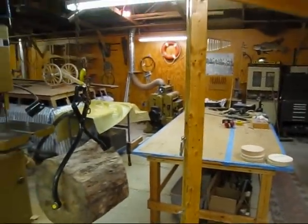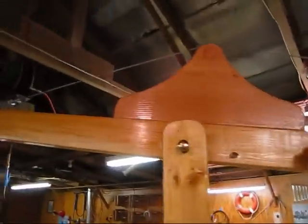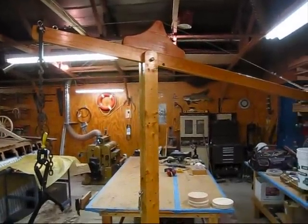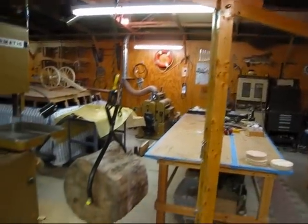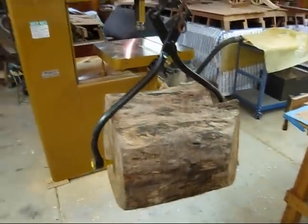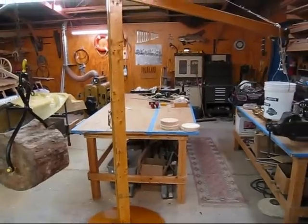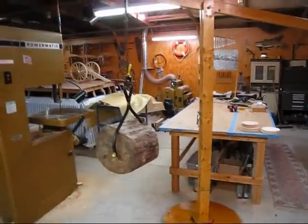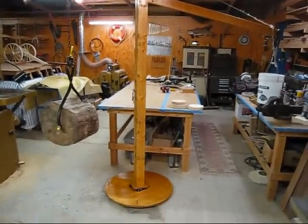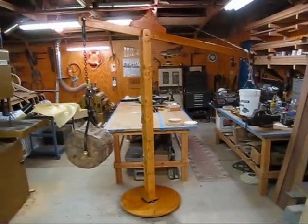I'm real happy with how it came out and I'm looking forward to going into the field and lifting some logs with it. Now that I have this top member stiffened, I wouldn't be afraid to lift 175 — maybe 200 pounds max — but I probably wouldn't want to go over that. That's going to cover most of the wood I bring to my shop, since I cut it to length 18 to 24 inches, and unless it's a huge round I'll split it on site. I think it's going to work well for probably 90% of the bigger stuff I cut up on site, and I'll be able to just lift it up and put it in the back of my pickup truck. I just wanted to start up the camera and show you the modifications I made to the manual jib crane.